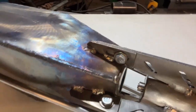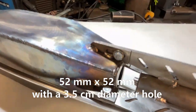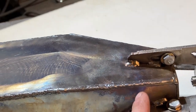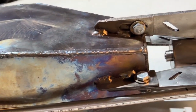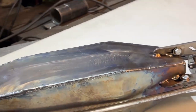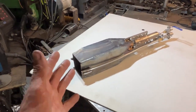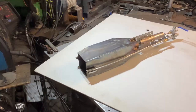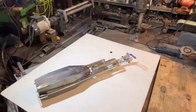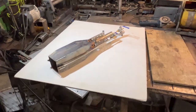I've grown outside of myself. This is the restrictor plate — it did give us that fire in the back end that we want. We reached about 600 degrees right here in the blue zone, and in the yellow straw color area we only got to about 400 degrees on the very back end, but we weren't running for very long — so that's good. This tells me that if we were able to get 100 to 120 PSI into this thing, it would look like one of my smaller Godzilla burners on a larger scale. We're going to see this thing tomorrow, run it a little bit longer, figure out the power output, and I'm going to run it on some waste oil so we can actually see the flame.